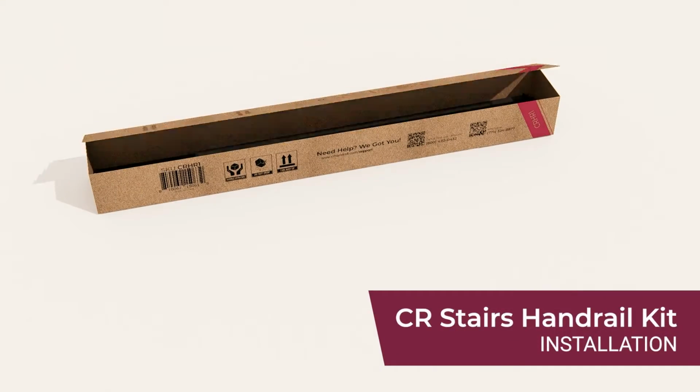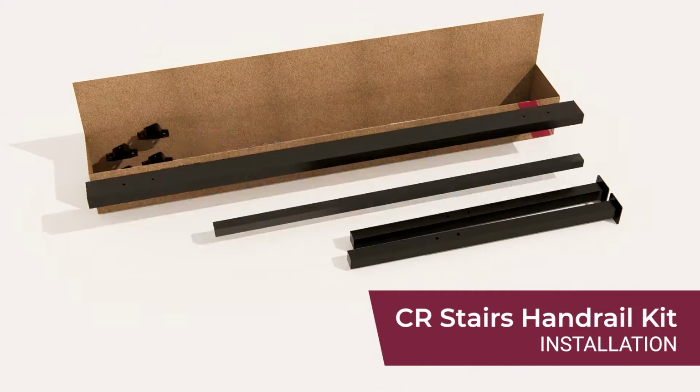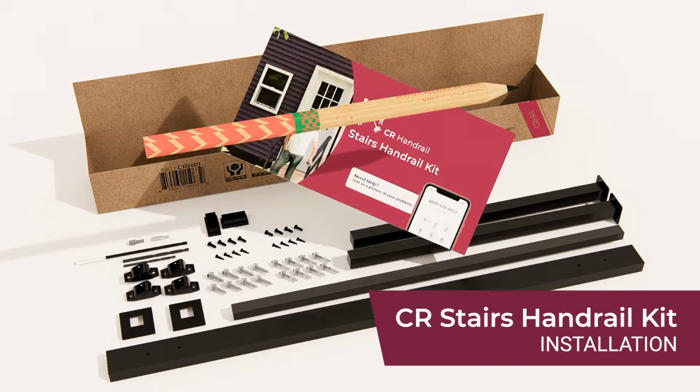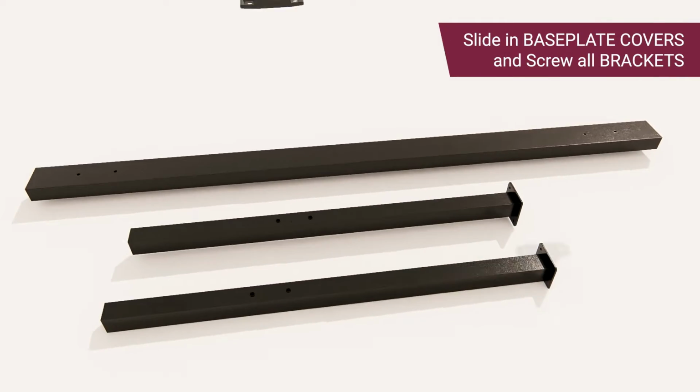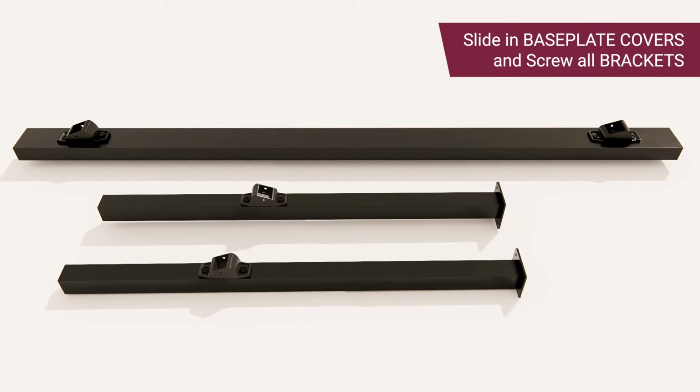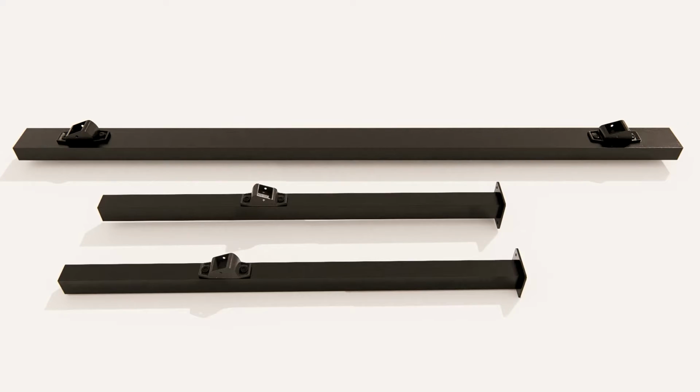Your CR Stairs handrail kit includes all the hardware and tools you will need to assemble and install your handrail easily. First, slide the base plate cover over the post and then screw on all the brackets. Please note that the upper post has lower bracket positions and vice versa.